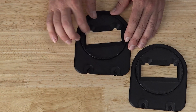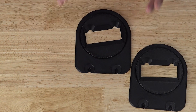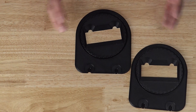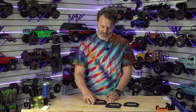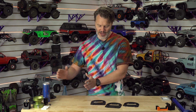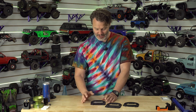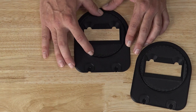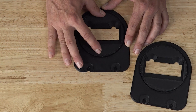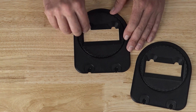Working with all the tolerances has been the most difficult part — just to get the tolerances in so that there's no wiggle left and right. Because otherwise, if you are moving it, you're going to have tolerance problems: you move the actual platter, say a millimeter, and you're getting 0.9 millimeters out of it on your first move, but then you'll get a millimeter after that once you take up your slack — your backlash, I guess this would technically be backlash. So I've got one more iteration to do because our backlash on these two pieces is a little too much for me, but the slides fit real nice.